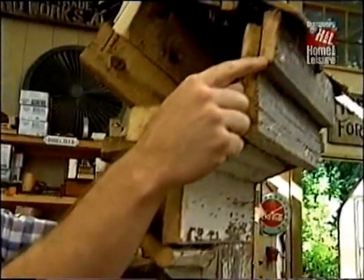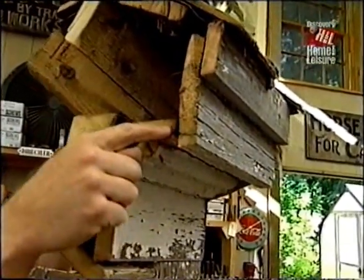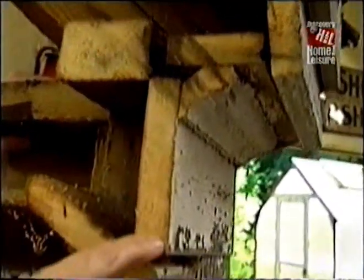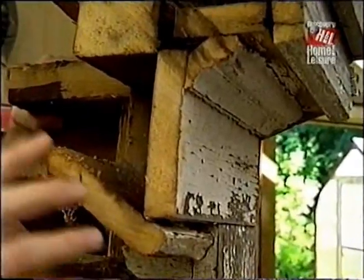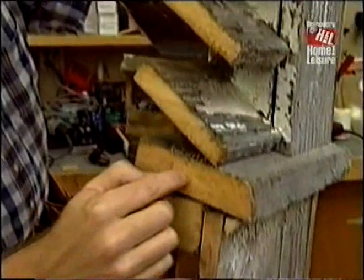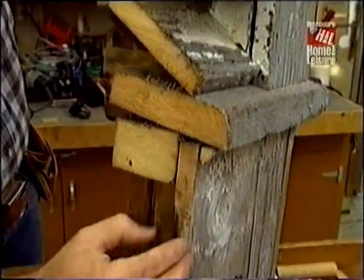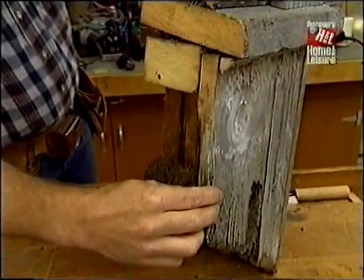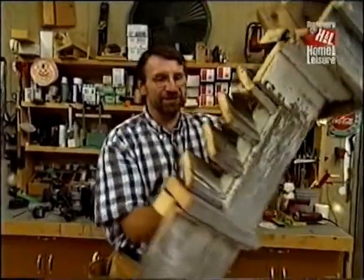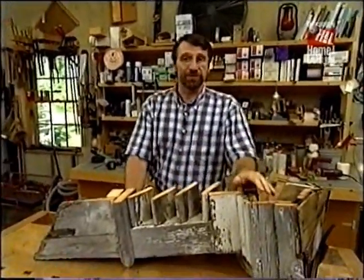Out here we have a small shingle cleat, a fascia board, a little soffit, a bed molding, and this piece I guess you could either call a frieze or the head casing of this louver. At the bottom of the louver, they used a sill, which allows the water to run off the edge. And they closed in the bottom just using some simple boards. From this section that I cut out, I was able to make a sketch and a materials list and pick up my material for the project today.